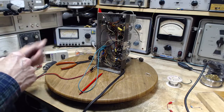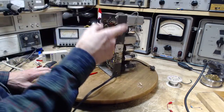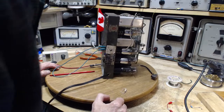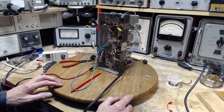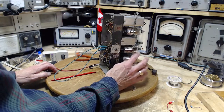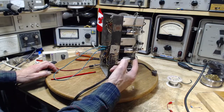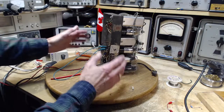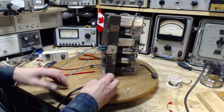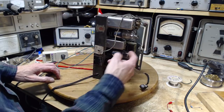Okay, power on. And what happened when I took the cap off this and tapped it and the thing just went into wild oscillations? What was that all about? That oscillation that we heard when the cap was off, that could have actually been caused by vibrations of the radio itself from the speaker. The speaker may have shaken the radio enough to transmit a mechanical vibration into the tube and set up a feedback, basic simple feedback. Could it do it electrically? They're not that far apart.